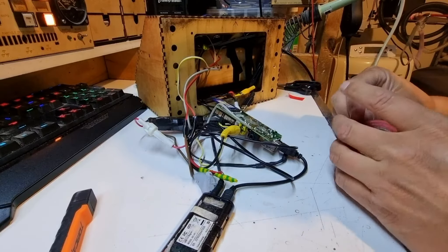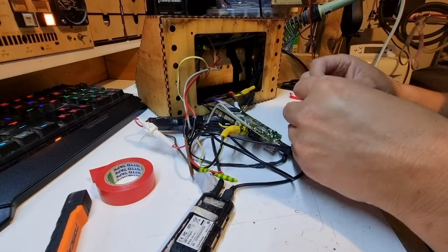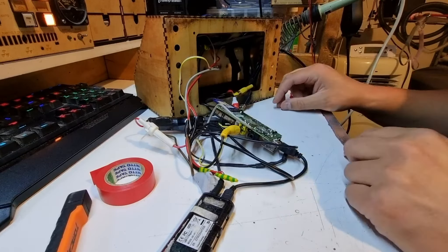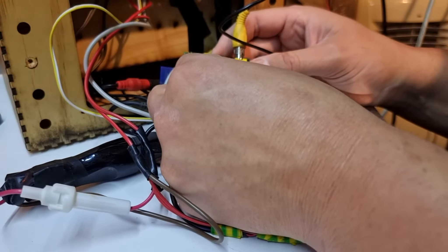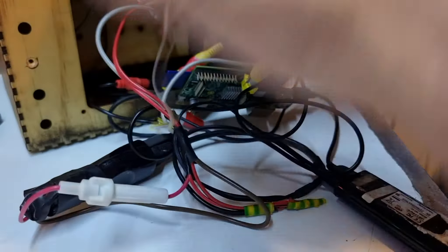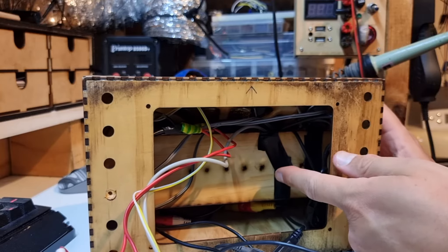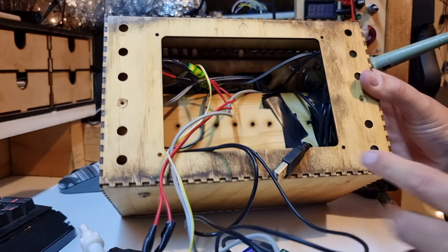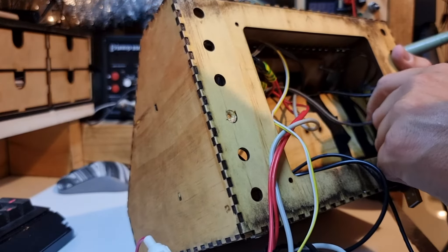I really did have plans to strip everything down if there was a major problem, but at the moment I feel like it's not a major problem so we might just be bodging this up again — but we will avoid that short circuit issue at least for the short term. These yellow leads are the shutdown button — three to four pins in on the inside edge. The audio amplifier board, which is a Jaycar kit, is actually on top of this shelf. Now we're in here we can have a look at the back of the trim pot.